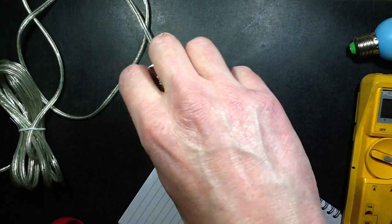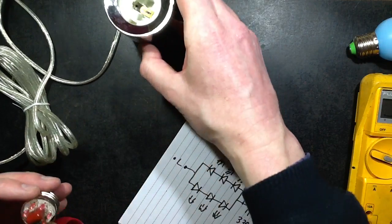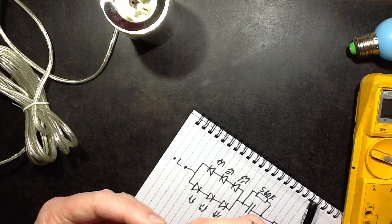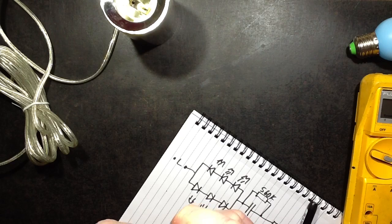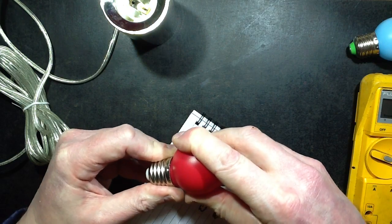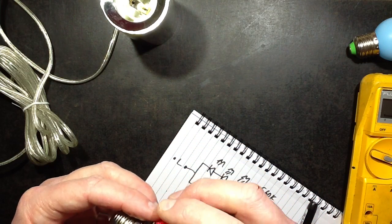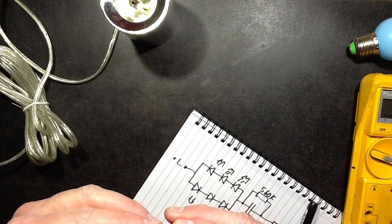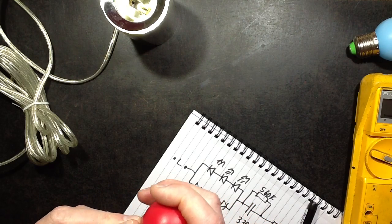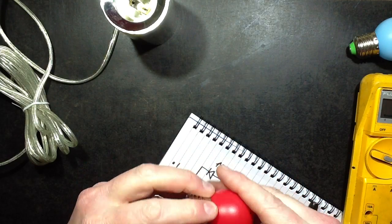These are another lamp that you stick in the lamp holder with the power off and the LEDs glow — perceptibly, just with the leakage through the switch circuit. Which is not over-unity lighting as I jokingly refer to it in another video, but it's just nice when something just glows of its own accord. It shows you that there must be some losses in the wiring in a house — although they're reactive losses, so it's not necessarily something you're being charged for.